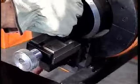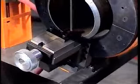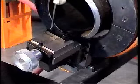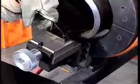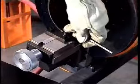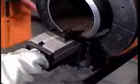Install the counter boring tool. If any adjustment needs to be made to the tool slide so that the tool does not touch the ID, it should be adjusted by the star wheel. Lock the tool into position using the supplied cover plate. Tool should be extended so that all of the cutting surface will be able to be used. Reinstall motor and air whip after the counter bore tool is set.